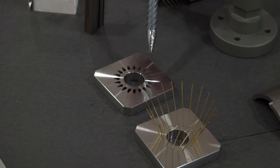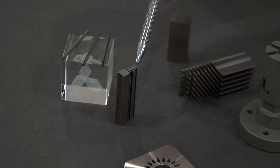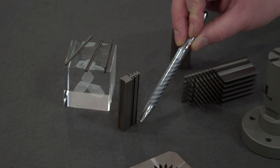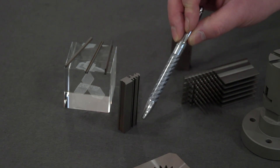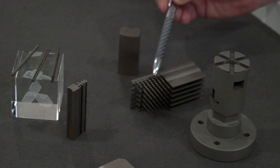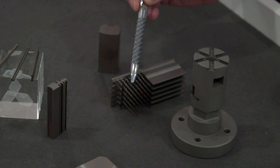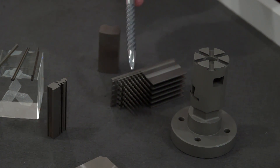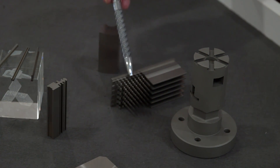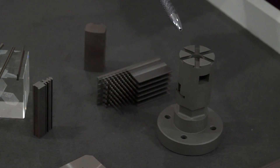Here is a selection of fine blanking punches and carbide punches where the manufacturer is trying to maintain straightness up and down the full length of the part with a very good surface finish. These kinds of parts are aimed at watchmaker and medical applications, featuring very small corner radius detail and high surface finish. The parts would be cut off, potentially with indexing during machining.